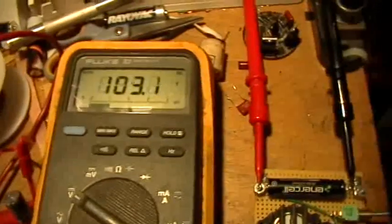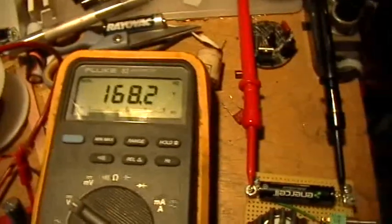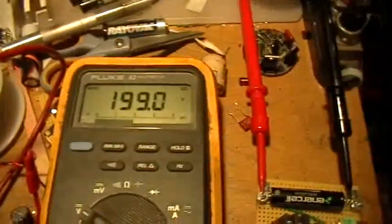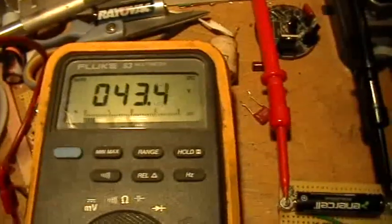We're here to measure the output of this Joule Thief. I'm going to touch the cathode of this diode to the anode of that diode. By the time the Fluke auto-ranges, we're already up to 80 volts — 138, 145, 150, 160. Those are volts. It's still going up, but I don't want to exceed the voltage of the capacitor. Now watch the neon when I discharge through it. We wound up with 45 volts still on the capacitor, because the neon stops conducting once it goes out.